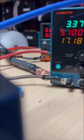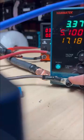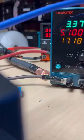I've had this down to almost trickle charging — like 1.2 amps going super slowly — then swapped out the wires and it went back up to full. If you are using your stock wires and you do a lot of charging, upgrade them; it's going to save you hours and hours of time in the long run. Four gauge seems to be a sweet spot for me because it's not too big for the terminals and it still has a definite improvement over eight gauge.